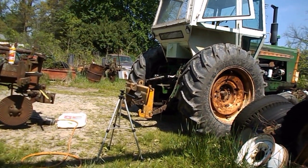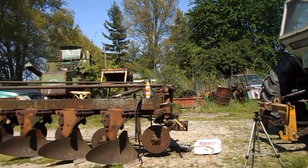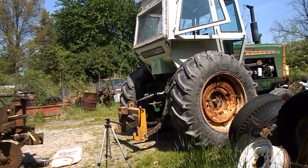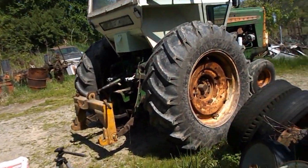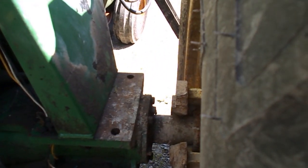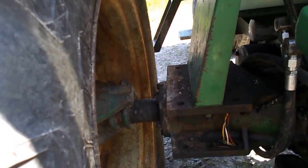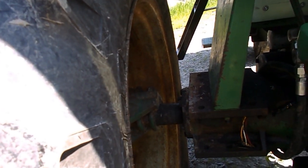So I have a choice. I can either loosen 6 bolts up and move that hitch, or take 9 bolts out of a tire that is loaded with a cast center with a wheel weight on it, off and try to loosen up 6 axle nuts, 6 nuts on U-bolts that probably aren't going to move, to move it about 2 inches. So that's not going to work. And even this side, you're only going to move it about 2 inches unless you take both hubs off and switch tires one side to the other. Just how it works.